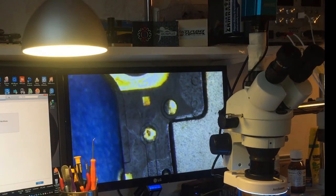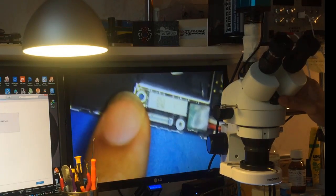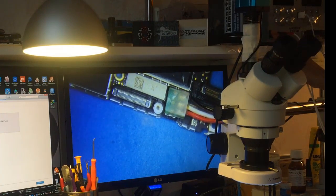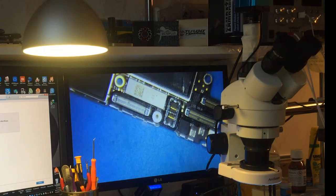Now we have to test the phone and see if the short is still there. Let's connect our motherboard straight to the power supply. The moment of truth — let me keep you connected under the microscope and let's see. We still have a short, we still have a leak in the energy, and of course the phone is not going to start with this leak.